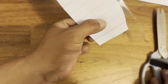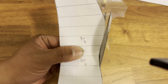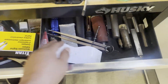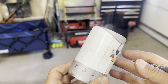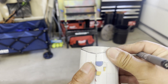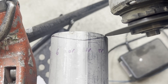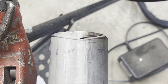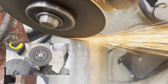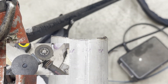If you put transparent tape on the coping template, it will last a long time and make it easy to draw lines. If you write down the size and store it in your toolbox, you don't have to make it every time. Wrap the coping template around the 2-inch pipe and draw along the template with a Sharpie pen. Then do a rough cut using a zip cut — I usually leave the line when doing a rough cut. In my experience, a zip cut with a small radius is easier than a brand new one, so I keep the leftover zip cuts to use later.